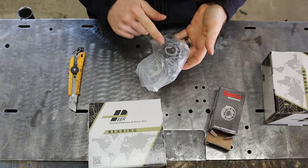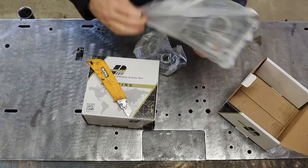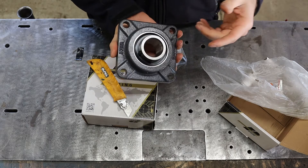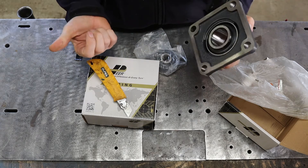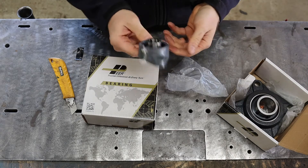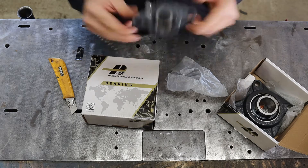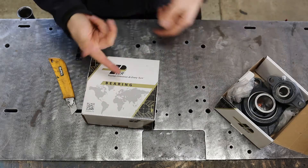This is to complete the rear assembly. These bad boys are for the main shaft — it's an inch and a half shaft that I will mount CV axles on both sides and the sprocket. The smaller bearing here is to take the load of the sprocket from the engine. It's pretty beefy for the purpose. My thing is gonna work great. Christmas is over — see you in 2021.